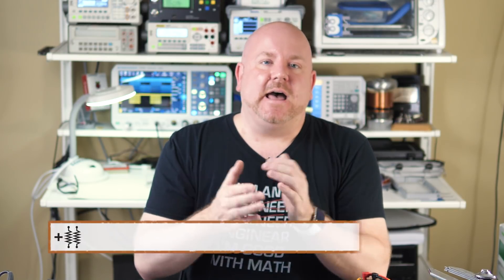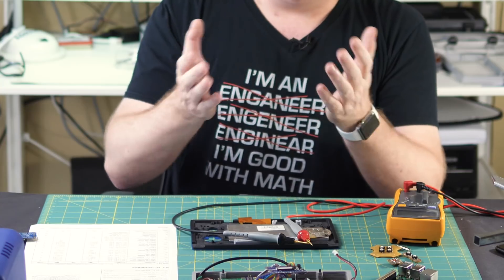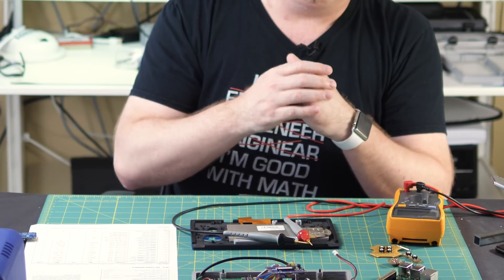The actual value is not all that critical. You don't need a complex formula or detailed explanation — just pick the resistor that works. It really is that simple. Thank you for watching another Adams Electronics tutorial. If you have questions about pull-up resistors, leave them with this video. Check out Adams.com for show notes, links to other stuff, and a link to our Discord. I'm going to get back to my Raspberry Pi project. Remember: if your circuit isn't working, just add ohms — between 1k and 100k.